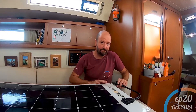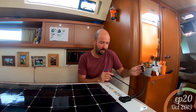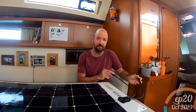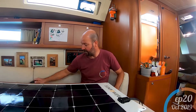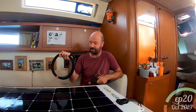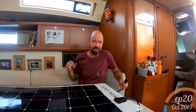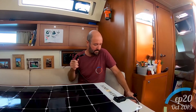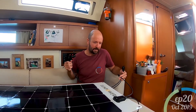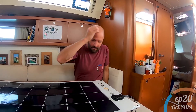Here are the two connectors — we've got three panels and we're going to install them in parallel, which means connecting up all the positives and all the negatives before running the two cables down into the battery bank. We've got two ten-metre cables, one positive one negative, and two smaller one-metre cables to connect the panels in parallel even though they'll be slightly farther apart.